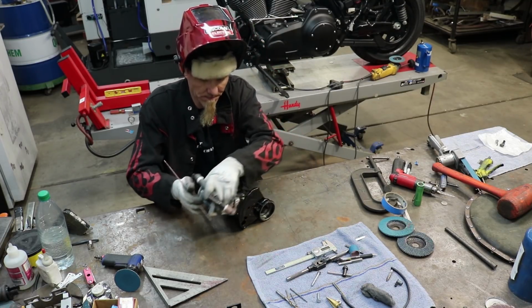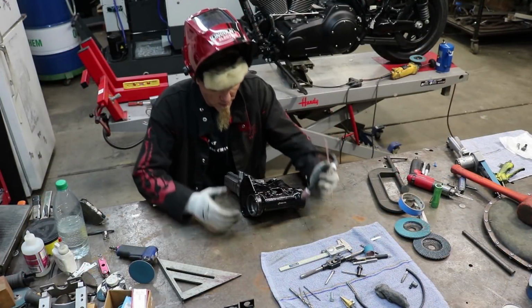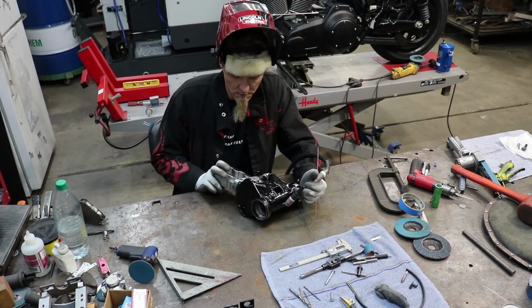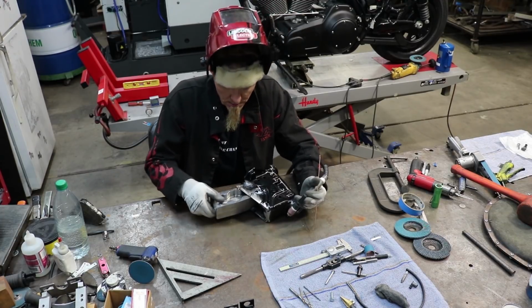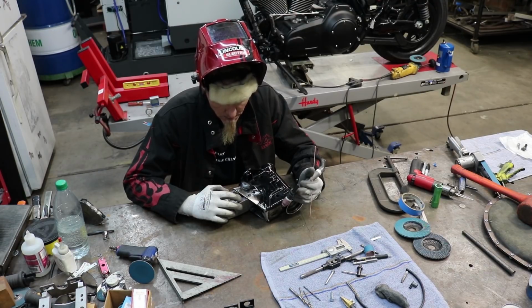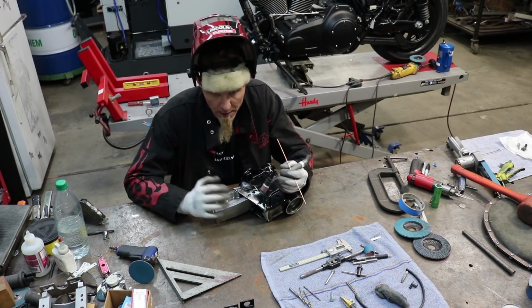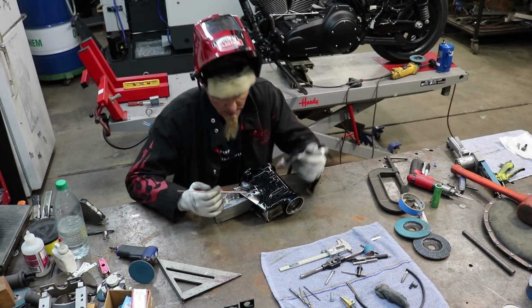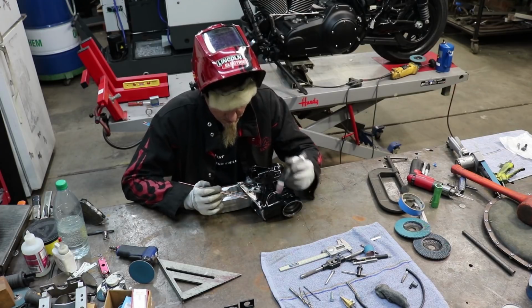There's our first one. Always remember when you're doing a rosette or a plug weld that you need to make sure that you melt into the block at the bottom of the hole and fill up the hole from there. Don't just start trying to fill the hole up, because if it doesn't attach to the bottom part, then it's no good.